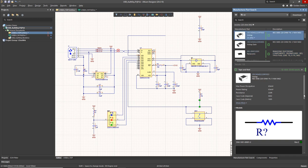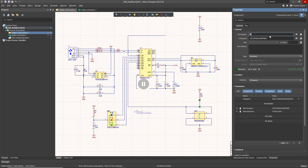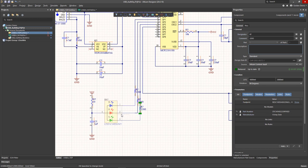I'll pick the one at the top of the list because it's plenty in stock and it's a cheap price, and I'll choose the nominal footprint again. I can place it directly. I'll set the comment to show the value as 220 ohm — note that I can use an ohm symbol there if I want; you can have Unicode characters in any parameter field. I'll insert those into the RGB drive lines and quickly neaten that up by moving and spreading them out.